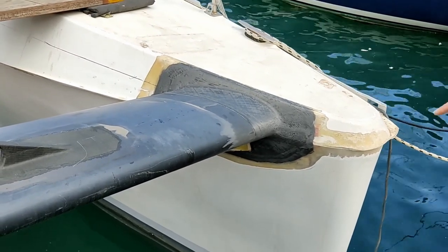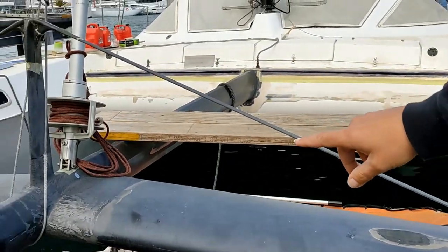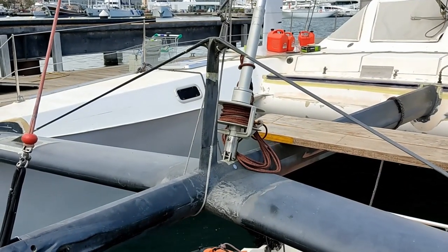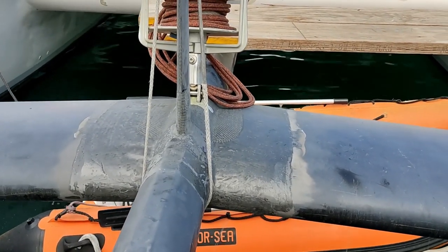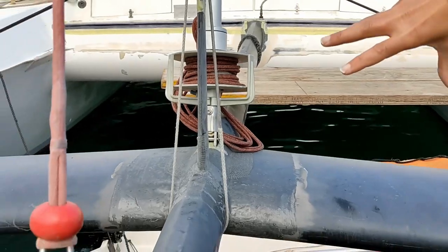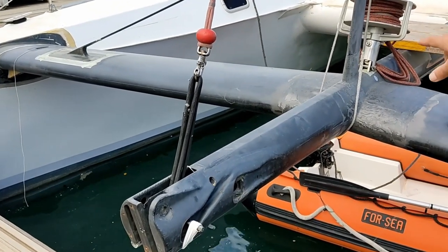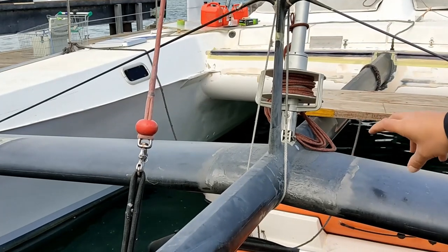That is also replicated in the beam-to-martingale connection. In the video we did a lot of double-bias in that connection along with some uni, but primarily double-bias because the main concern is the torsional load going through it. The compressive load is very easily dealt with by two large lumps of ex-America's Cup yacht mast trying to crush the middle piece. The compression load is pretty easily dealt with, the bending moments are pretty well dealt with by having the whole martingale arrangement on there. The connection is dealt with using different types of fibers in different places taking different loads.